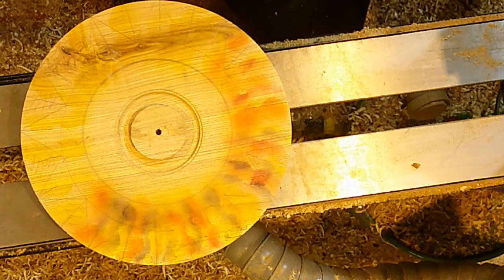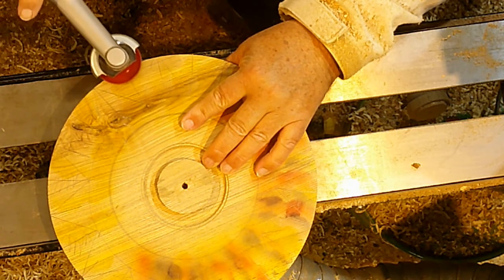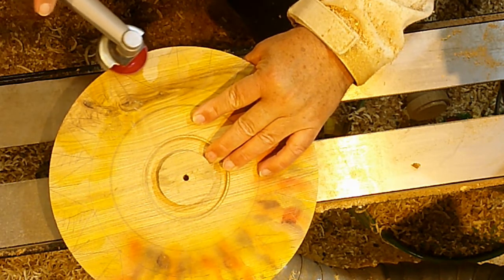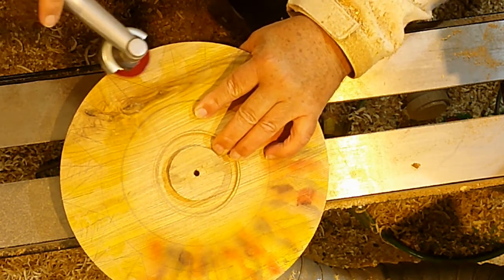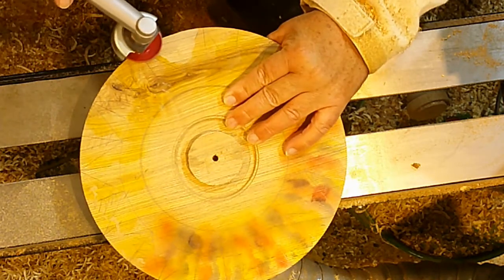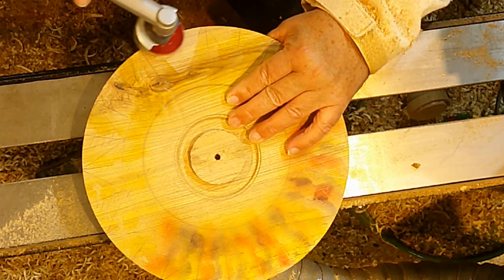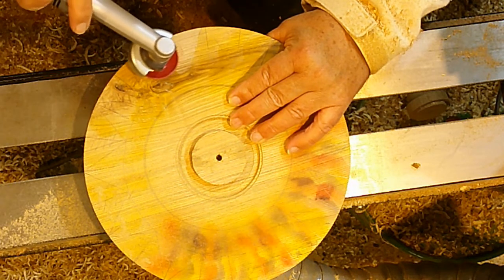So now we get to grinding the scallops away. I have a swan neck grinder fitted with a sabre burr. It's a very coarse one, so it does rip away very, very quickly. From the video you'll see what I'm doing - I just start along the line in the centre of the triangle and gradually work my way out to the two lines at the side, just gradually taking the wood out of that triangle. What I'm trying to do is achieve a nice curved shape, and what I'm aiming for is to get the depth of that triangle down to the pencil line we put in the middle of the rim, just gradually working it all the way.